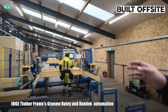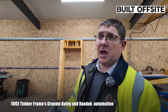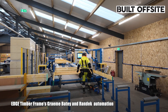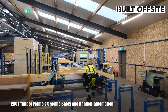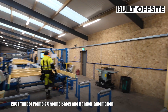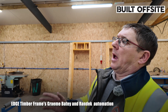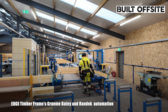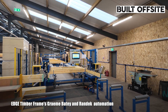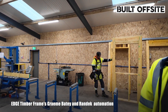Once the panel's made, it goes into the nest station. We drop the insulation in — some clients get the insulation off us and we'll factory fit it, some will take it and insulate on site. Once the insulation's fitted, it goes onto squaring table number one, where we square the panels and make sure it's all square. Then we put the OSB 3 racking board on, tack it, and move it onto the nailing bridge. The nailing bridge nails all the OSB to the correct centres as the engineers have specified. Once fully nailed, it goes onto the nest station and we wrap it in breather membrane, ready to go onto site. We've also put in a sideways move table, and some clients are going down the route of factory-fitted windows, which gives us the perfect opportunity to add extra value for the client and save time on site.